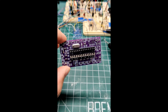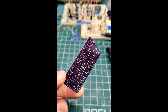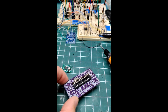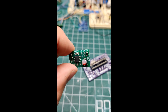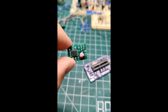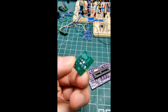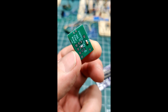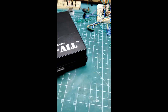My next task was to design a development board around the ATmega328, same as what the UNO board uses. The board has options for using MOSFET drivers for the LED lighting or direct I/O connections. This design has four programming modes and I needed to debounce the programming switch since it is going directly to a hardware interrupt pin. For this I made a 555 timer development board that can be used for this and other 555 projects I may have in the future.